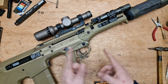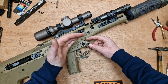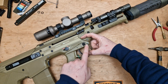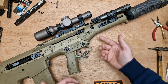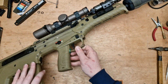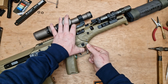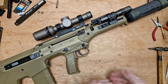I'm going to see if I can measure a few things, relay that back to them, and see if we can identify which part it is. I imagine it's either this bracket — and I can't just remove it, because this bracket gets fixtured to the rifle and bolted through this way. I can't just face that off to bring this up, which would fix the handguard and lower receiver wobble, because then the fixture for the handguard would move up as well and that might not fit. There are a couple of things we could try. You can actually see the bracket at the bottom here — I could drill and tap that, put a grub screw in, and as I wind the grub screw in it's going to push that pin up and create the tension there. But it still is a bit wobbly even if I apply pressure, so we'll see what Silverback come back with. I am giving them time to fix the issue.